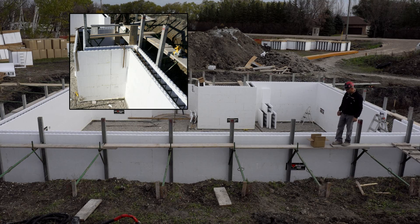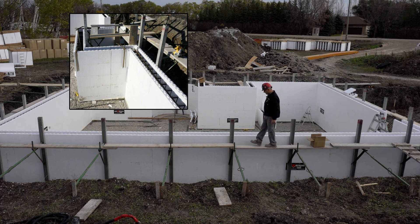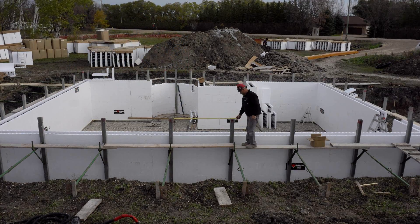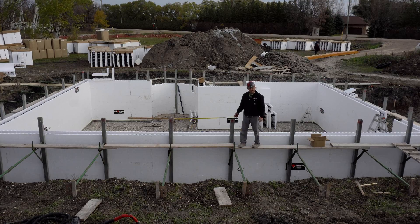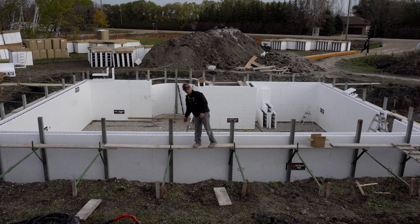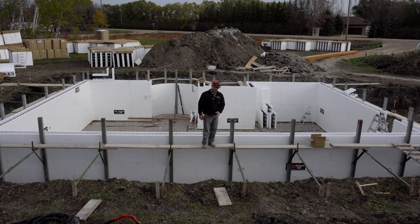We don't always do it this way. We have brackets holding the planks — the planks are not resting on the turnbuckles so the turnbuckles can still work fine. We're going five foot four on center. The reason we did that is the longest planks this contractor had were 12 foot, so if we went six foot on center it would be really hard to get an overlap with the planks. We have to look at what planks are available on site to know what spacing to put the bracing at.